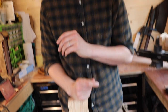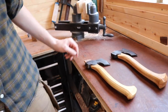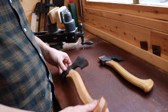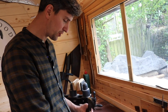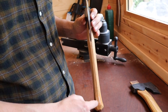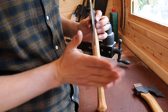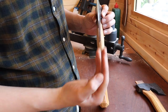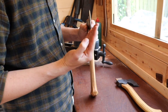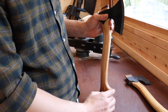In the next video you'll see how to make an axe handle out of this ash. One final important point discussed off-camera: making sure the head itself is straight and not misaligned. It's quite common but really important — if you look at the axe handle and head from the front and draw an imaginary center line, the edge of the blade must be right in line with that. It should not be twisted in either direction. If it's a little out it's not worth cutting the handle off, but a large twist could definitely impact your technique and how you use your axe.